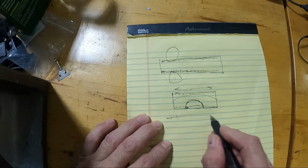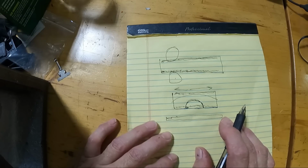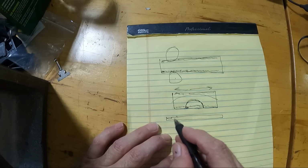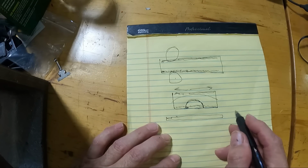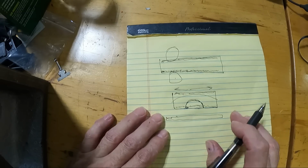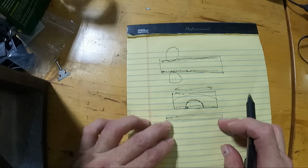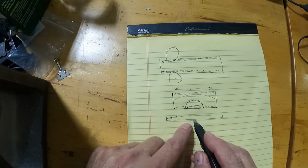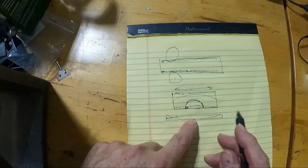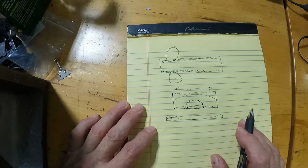So if you're trying to face a flat piece of material that's thin with a face mill, for instance, I did a video a while ago on facing down some titanium pieces that were 800 thousandths thick to 3/8 of an inch, I believe, and I had to maintain about 4 thousandths flatness of the pieces. That's a difficult thing to do with a face mill, because if you let the inserts get dull, it tends to expand the surface of the material where you're cutting, and it warps the part away, kind of like this, from the surface. It's putting this compressive force back into the material the way you're cutting it.